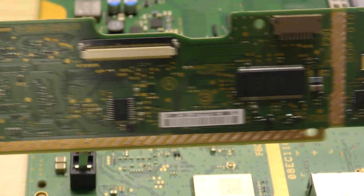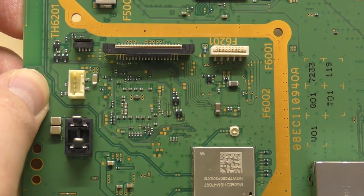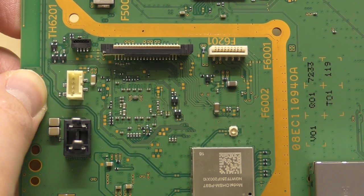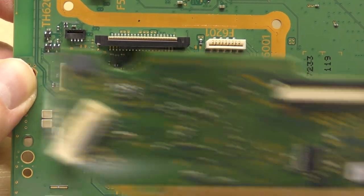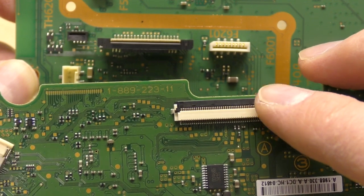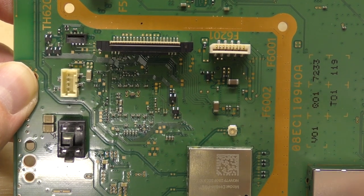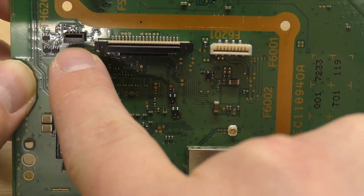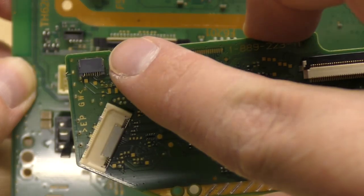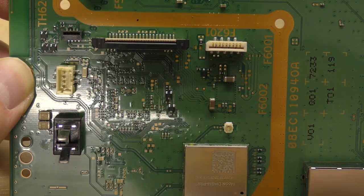So what can we learn about the present by looking at this old board? Well, if we take a look at the connectors, all looks familiar. We have this big old long connector here, which looks a bit like this one, don't you think? That one actually leads across to our laser ribbon, so that long connector and this one match up. We have this small 8-pin connector here, with 4 pins on both sides. It looks very similar to this 8-pin connector here, so we can probably assume that part of the circuit is effectively done through this port here.